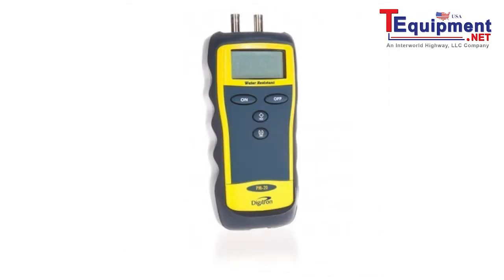The PM80 differential pressure meter offers great performance at an affordable price, specifically designed for heating, ventilation, and air conditioning engineers to aid soundness testing and the testing of boiler differential gas pressures. This robust and reliable instrument is waterproof and is supplied with a rubber boot. It can be magnetically attached for ease of use, and the backlit LCD allows easy viewing in poor light conditions.